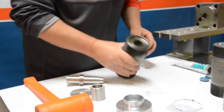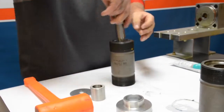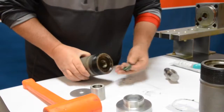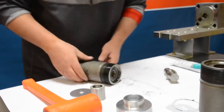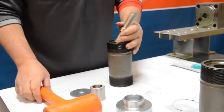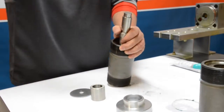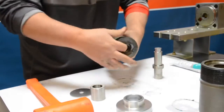Let's set that cylinder aside and get into the second cylinder. We're going to fast forward through this but we're repeating the same steps. Remember to start on the flat side of the cylinder using the spudded side of the tool. When you flip it over, make sure that the cylinder liner stays inside, using the flat side of the tool and holding the cylinder at a slight angle until that seal and hoop pop out.